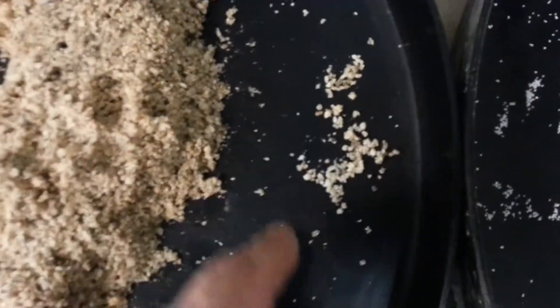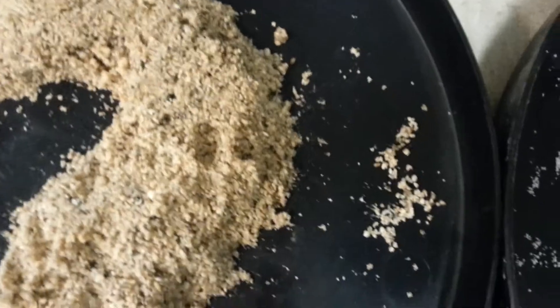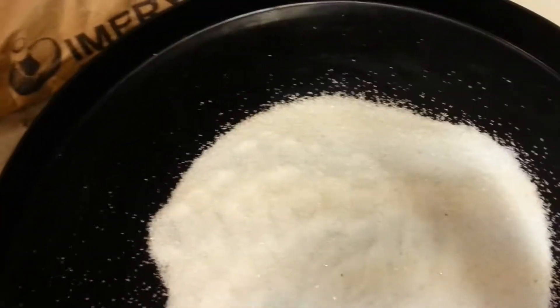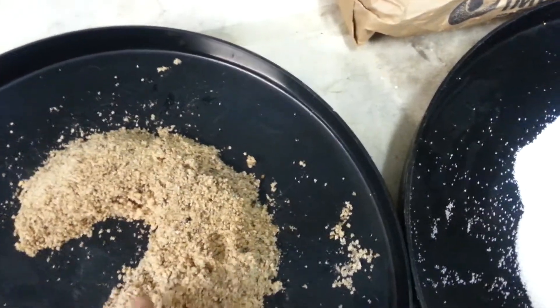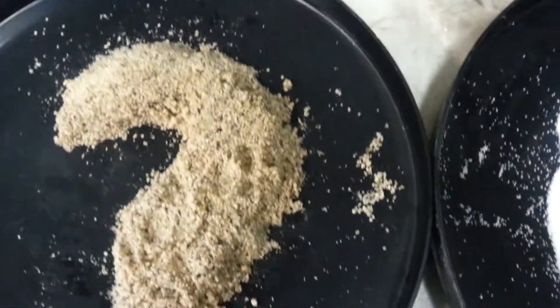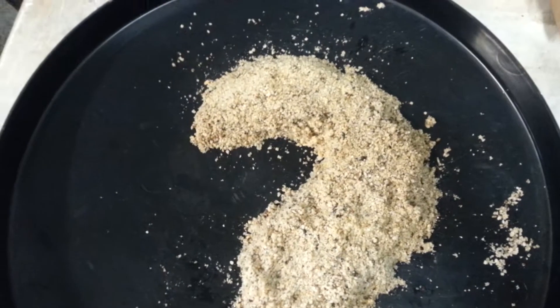Also, there are many impurities here, so I can guarantee you that this is actually limestone-crushed and not a crushed marble like this is over here. Limestone is not always marble. Marble is a type of limestone, but pure marble — like this white stuff here — is 100% dense calcium carbonate. Whereas limestone may have other kinds of stones mixed in, like maybe a little granite or feldspar or some other stuff, and when it gets crushed it's all mixed together. You can have up to 20% of undissolvable product in the neutralizer, and therefore it cannot raise the pH. It's stuck — maybe it'll raise it from 6 to 6.5, but it'll never raise it to 7 because you have non-reactive product in the system.